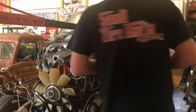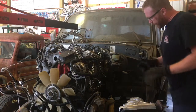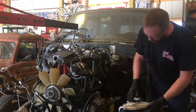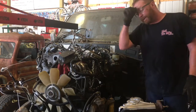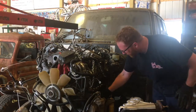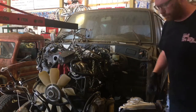I'm going to go in and grind it down so it looks a little better. You'll have to excuse my neighbor — he's mowing. Now, real quick, the dilemma with the driver's side is I'm hitting the manifold on the engine mount. So I'm going to pull that off, trim it — it probably needs about a half inch — with the plasma cutter, then clean it up with the grinder, repaint it, and put it back on.